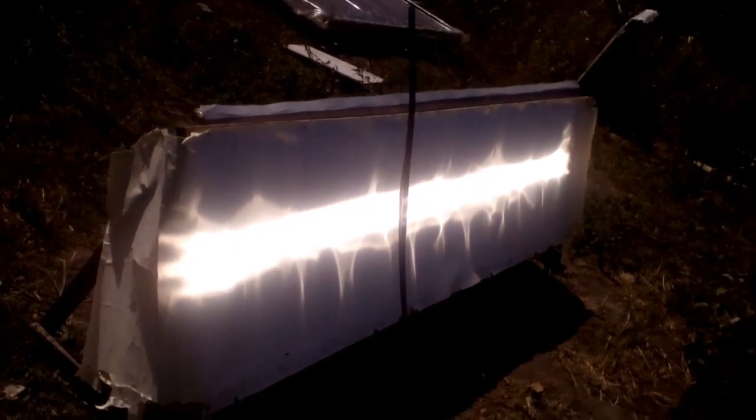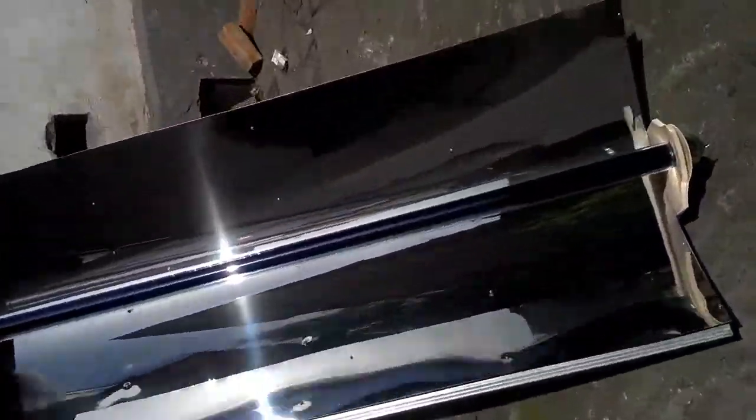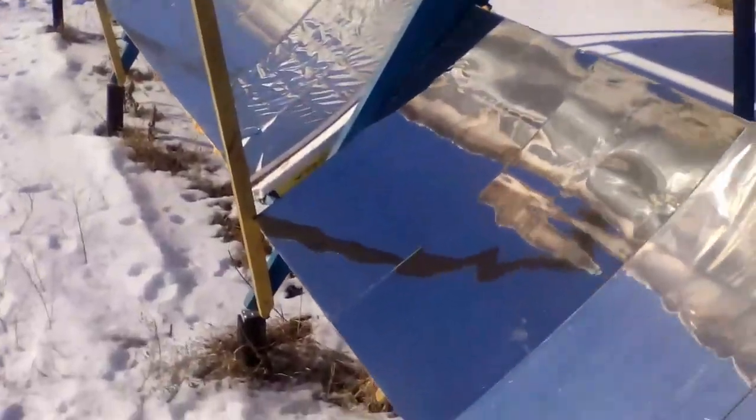We can notice that the height of the spot is less than 10 cm, while my stainless sheets have a total height of 170 cm. If we need a lower spot, we must use a different type of fixation of stainless sheets on a solar concentrator. For example, the stainless sheets of these solar concentrators focus the solar radiation more accurately than my concentrator. These stainless mirrors of my solar station are another example of accurate focusing, and I installed them 3 years ago.